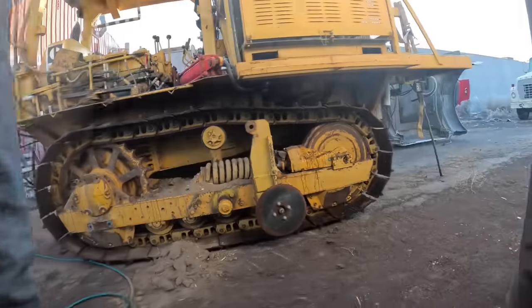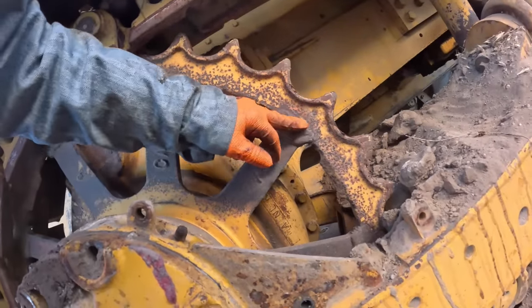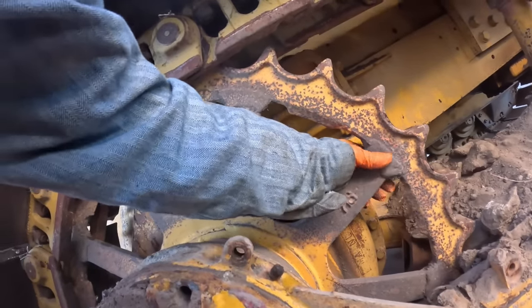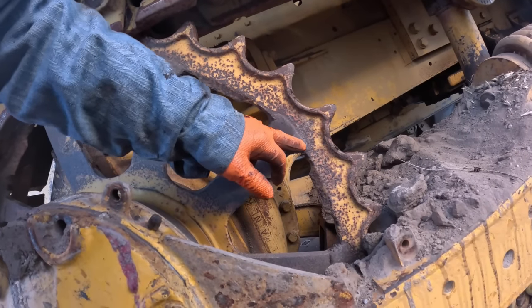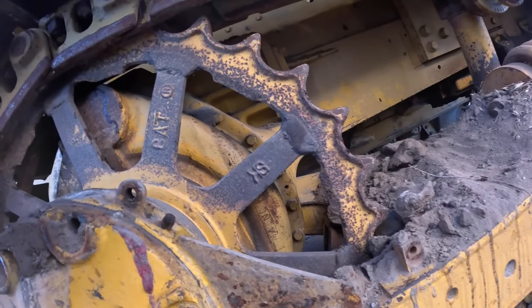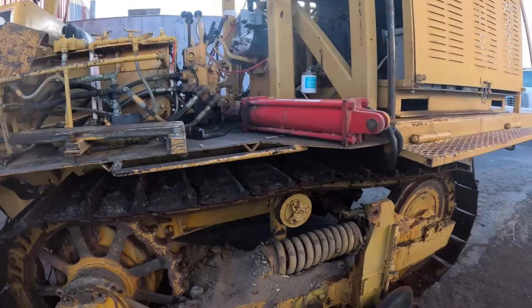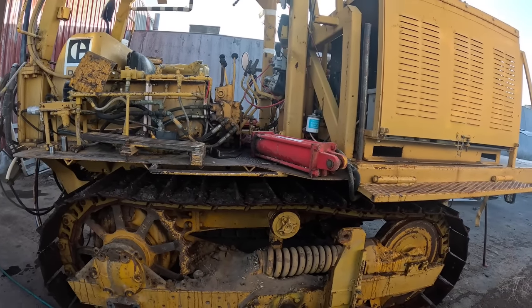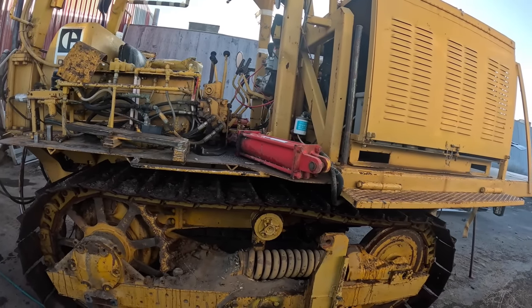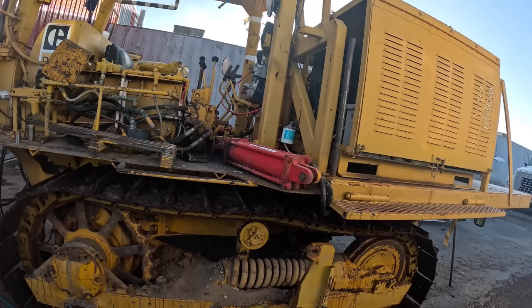They sure gobbed the weld on that thing when they did it. Look at that, boy, a big gob of weld on there. That's where the air arc comes in really nice. You can just get your amperage set right and go. I'm not the big expert at air arcing, and I never claim to be, but I've run one long enough, and I've seen people run them long enough that do know what they're doing.